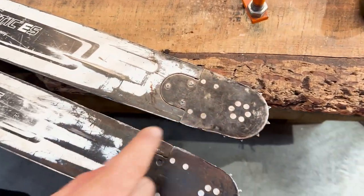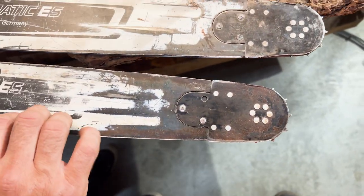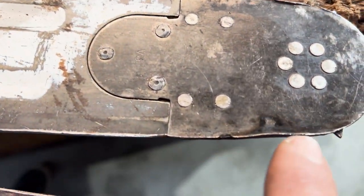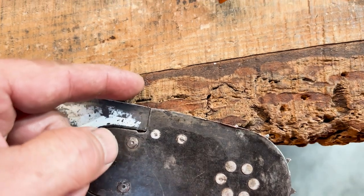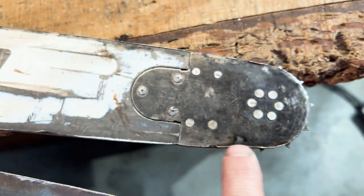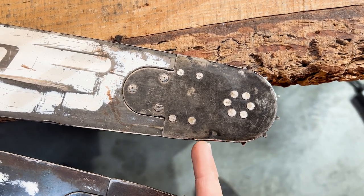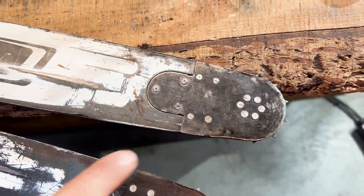We'll do the tip on this one. When folks are going to change a tip, what they look for is the rolling of the edge. Eventually it'll get so worn it'll get a moon shape out of each side as you flip and rotate your bar. As the chain comes around it starts to pothole — the chain comes around the tip and slaps into that portion, wearing that area — that's where you get the rolled-over edges.